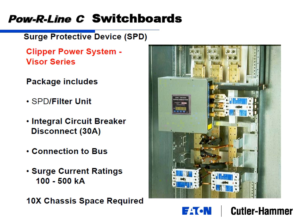For any type of commercial or larger installation, I always use the bolt-on, number one, because you know it's a fixed electrical connection. Safety, less heat loss, which means less money you're paying the utility for nothing. And you can get bigger ratings. I think the maximum plug-in you can ever get is 100 amps, and bolt-on will take care of anything up to 5,000.